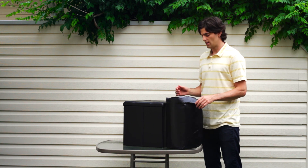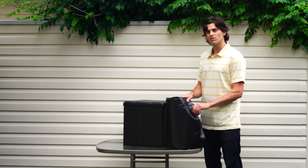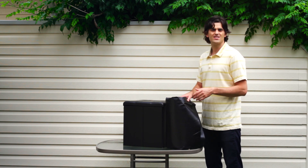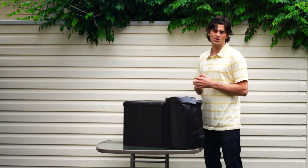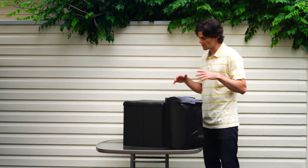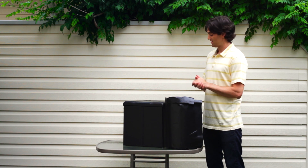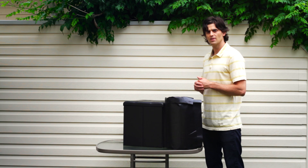If you have a large area to cover, this is immediately going to be easier to install. Because it's reinforced it's stronger, but that does add a little bit of stiffness. It doesn't stretch like EPDM, which in some ways is a good thing because as you stretch EPDM it becomes easier to puncture in the stretched area. What I'll do here is lay this liner over top of this box just to see how flexible it is and whether it can still be folded around tight corners.